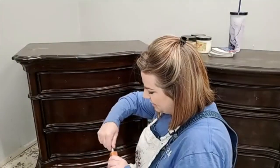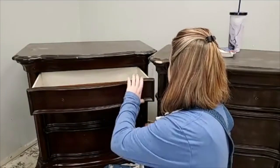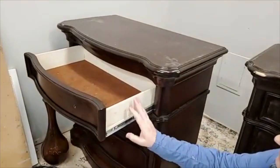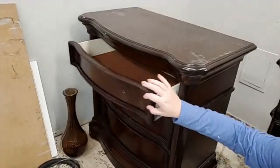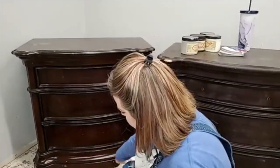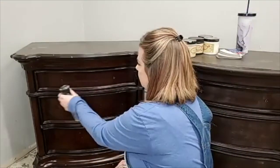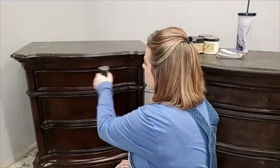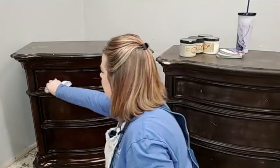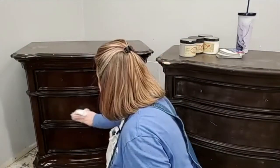If I look at what my pieces are actually made of, they're stained a dark wood. But if you look at the interior of the drawers — the drawer back and sides — these are actually a light-colored wood stained dark. So it's not a dark wood, it's a dark stain. There's a difference between a dark wood and a dark stain. Once the piece is cleaned, you need to rinse your cleaning residue — cleaners leave a residue just like furniture polishes. You need to rinse that away, otherwise your paint is going to attach to your cleaning residue instead of attaching to the actual surface.